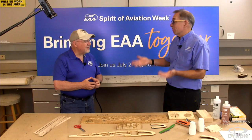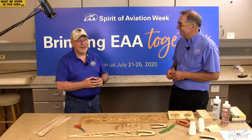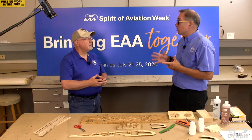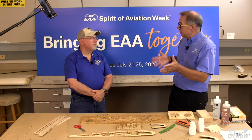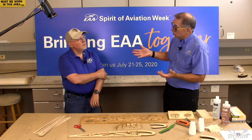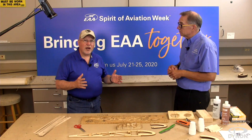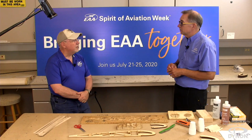Aircraft Spruce gets its name from initially providing spruce material — it's the first thing they sold. Because of the scarcity of spruce, we've found ways to substitute Douglas fir, some mahoganies, and even some ash, depending on what the structure requires strength-wise. You can actually still buy wood from a specialty aircraft supply house already graded and inspected. Spruce's strength-to-weight ratio is probably the best of any of the woods, so it's still the go-to if you want to build strong and light.